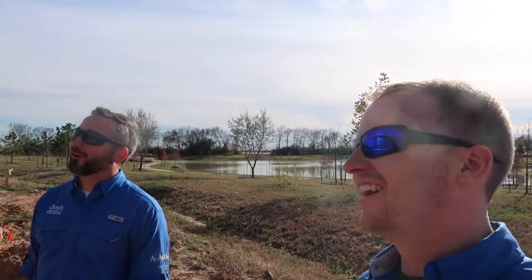That's Josh, the destroyer of phase twos — and what we like to say is: he earned his paycheck today. Lots of good stuff, made it worthwhile for the phase two. One thing we want to close with: you always want to follow up and make sure they did it correctly. You can come out, take pictures, send it to your inspector. Your inspector will normally respond, or you can hire them to come back out for a follow-up re-inspection, because we have seen builders just start building over issues. They're on a tight timeline and they're not checking all this stuff. It happened just last week — I did a re-inspection on a phase two and not only was the window flashing improperly installed, some of it was just missing, and I got there and they'd already bricked halfway up the wall. Still no flashing, still wrong, still holes. So if you have any home inspection questions, please give us a call. See you guys.